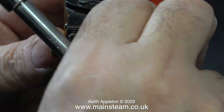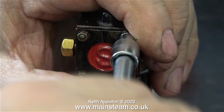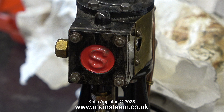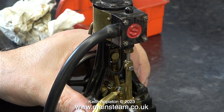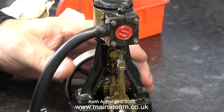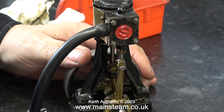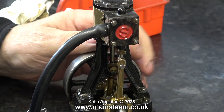There isn't a gasket fitted between the steam chest cover and the steam chest, but that shouldn't matter — a bit of a leak won't make much difference to this test. I really do hate to see steam engines where every part has been painted. It may prevent the parts from rusting externally but in my opinion it looks horrific. I connected the compressed air line, lubricated all the moving parts, opened the valve slightly on the compressor, and spun the flywheel.